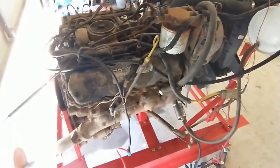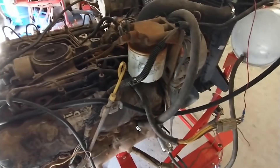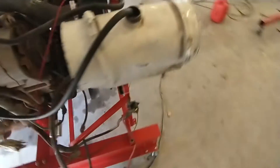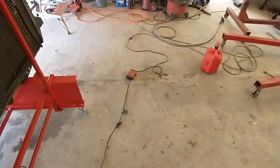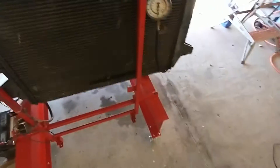This engine doesn't run perfectly — it may just be a fuel issue. I didn't bother dumping the old fuel out of the filter; I just hooked up the fuel source to it and cranked it until it started. I didn't have to crank it very long. This battery is not strong enough for this engine — it goes dead very quickly — so I keep it on a trickle charger, but it will start the engine.